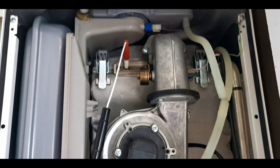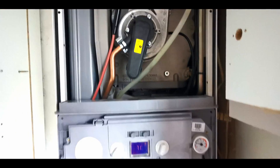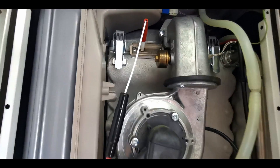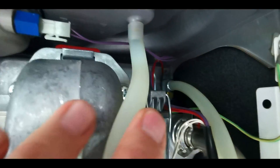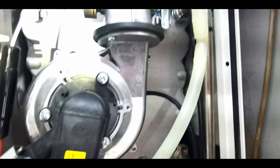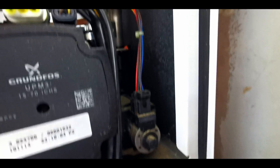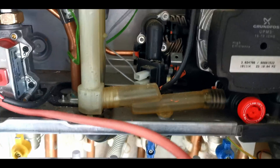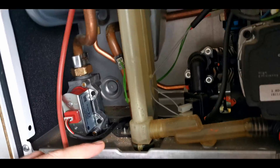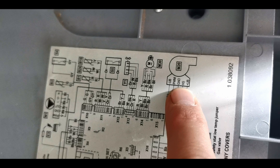Here's the front cover off and the top cover off. We'll do a little overview of what's in there — just the normal stuff, making sure you understand what's in the boiler before you start working on it. There's something quite interesting on this boiler. Looking at it: we have an electrode, a flue sensor, a sensor on the front of the heat exchanger, and one at the top right corner. We have an air vent on top of the heat exchanger with a rubber tube, a standard fan, a water pressure switch and a flow switch, that red gas valve, diverter valve, and ERP pump. This is an unusual combined PRV and condense, so you only have to run one pipe away from the boiler — that's really smart. Nicely, they've also shown you what the PWM signal is and what the hall sensor is doing.